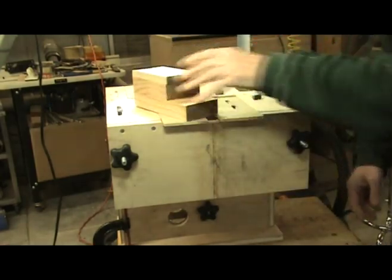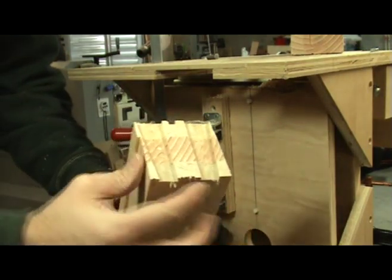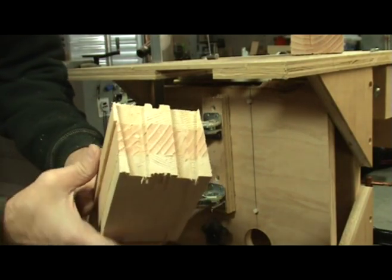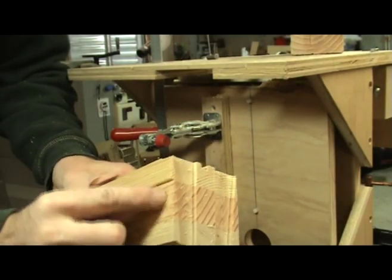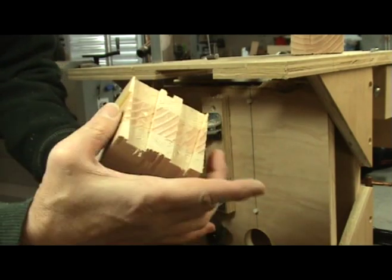Here's the body, and on this side I've got the tenon, or the neck. Now you'll notice that since my neck, or my test piece, is too wide, I've got some scrap over here. I'm just going to come in and bandsaw that off of there. Normally you would have already done that anyway with your neck. I like to pre-shape it a little bit. Also, remember I talked about fuzzies on the edge, so if you're the guy that likes to carve right up to your final measurement, you want to put some masking tape or something on there so it doesn't blow that out.